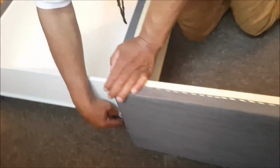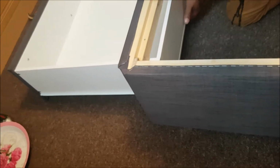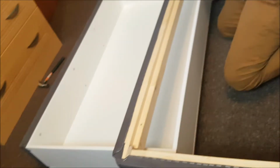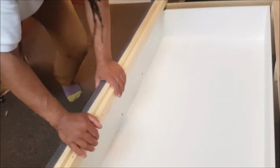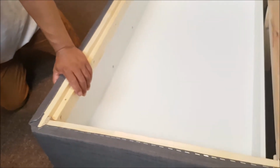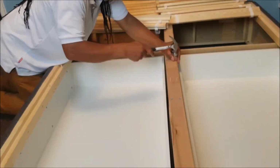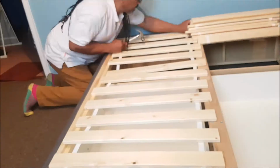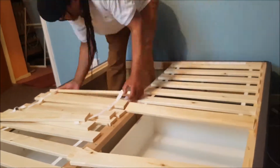Right, here's our first drawer we've put together, right? Now, we've got pegs that go in here, in there, and in there, locates in there, right? We've got our screws in. We haven't tightened anything down, right? Again, we have all our screws in along here. We haven't tightened anything down. In between the two panels, joined about there, there's a peg there and a peg there. Those two pegs must go in. We've got our screws here all lined up. We haven't tightened anything. Again, at the bottom, the same thing. There, there, there. We catch everything. Make sure everything is lined up. Everything is where it should be before we start tightening everything.